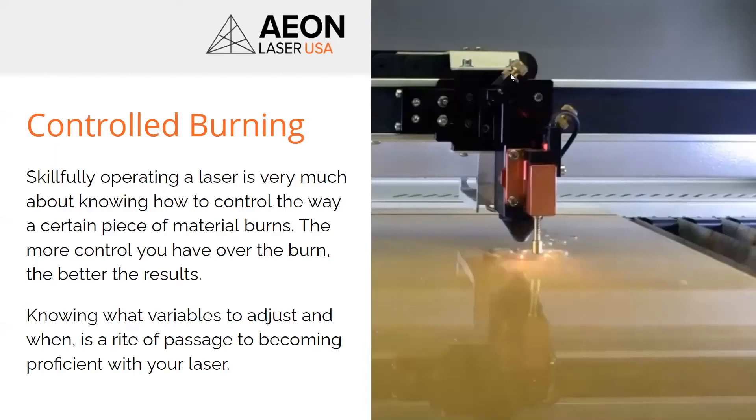There's a question about whether air assist automatically comes on when engraving and cutting. Yes, it will. There is a little valve inside the machine that will trigger the air on and off once you hit start. It's a little toggle switch in your settings — each layer has it and it's called air assist. You definitely want to make sure that's always on; it should be on by default. If you're cutting and you see a flame, that's usually a good indicator that you're not getting air out of the nozzle, and that's one of the first things we ask someone to check.